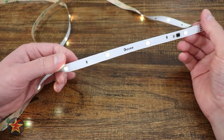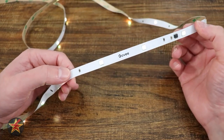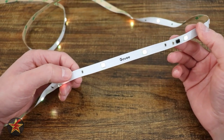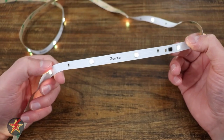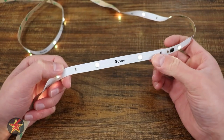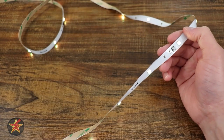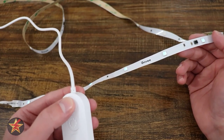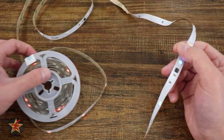Now there are a lot of things to like about the Govee light strip, but there are a few cons I wanted to let you know about. First, there is no cover — no epoxy coating — on the LED light strip, meaning that when I touch specific points, it turns itself on. That's not good. As this is the only Govee light strip I've tested, I don't know if it's just this particular model or all Govee light strips, but other LED light strips I've tested all had that epoxy coating. Additionally, if I turn the power off, power is off, but you might notice the blue is lighting up and there are a couple of red sections.